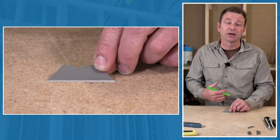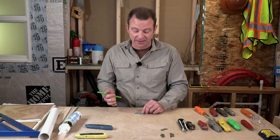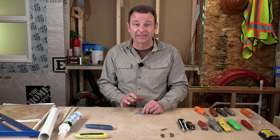That's why we go through this process of disposable blades and changing them out. When it comes to safety, a fresh sharp blade is much safer than a dull one. A dull blade doesn't cut well — we add more pressure and then we're out of control. A knife that's out of control is an injury waiting to happen. Remember that these blades are replaceable, and replace them when needed.